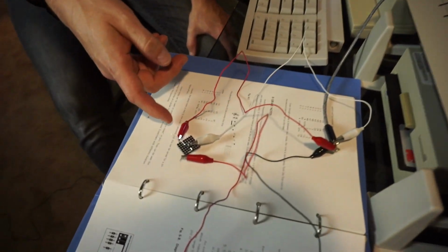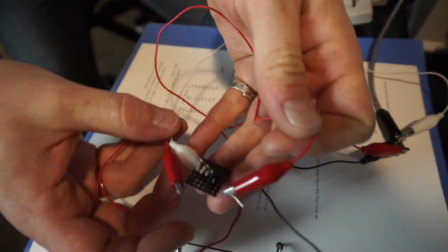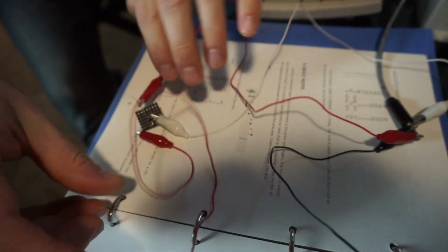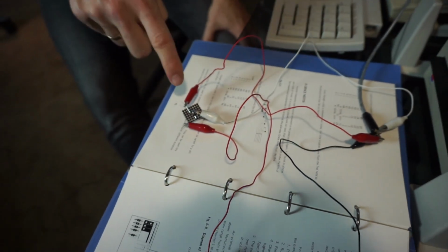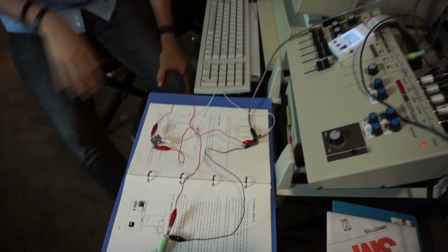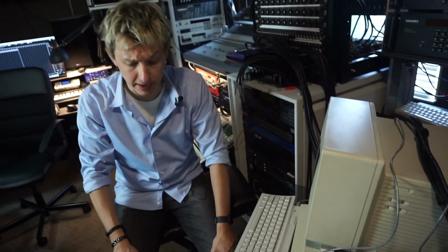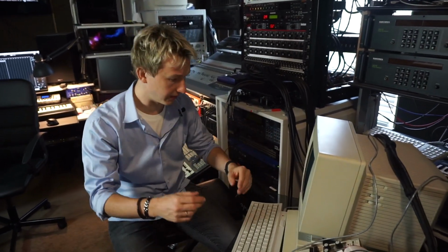and it's not actually a cable. It's just a breadboard with one transistor, one diode, which is here, and a couple of resistors, and that's it. This breadboard sits in between, and the transistor connects V-trig to S-trig of this unit. That's the way it's designed. Let me quickly show how it's working. So now I have everything set.